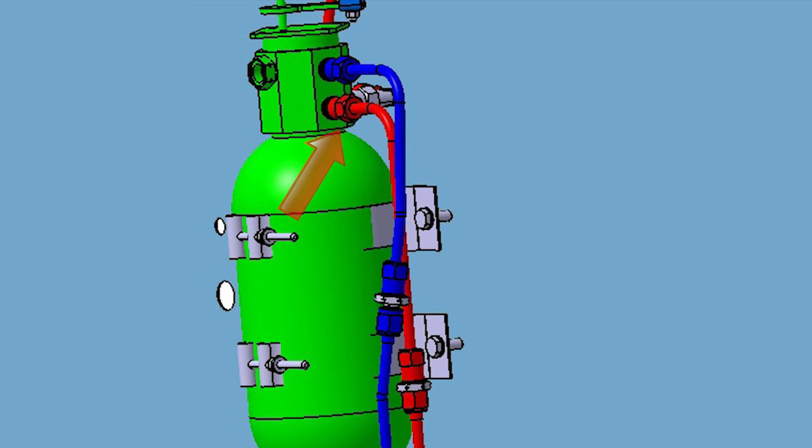Reconnect the fitting at the nitrogen bottle. Disconnect the vent line as highlighted from the nitrogen bottle. Use an isopropyl alcohol and shop air flush at this fitting until it runs clear at the vent line at the right side of the nose.